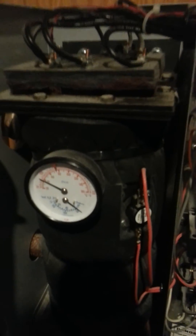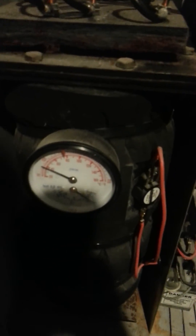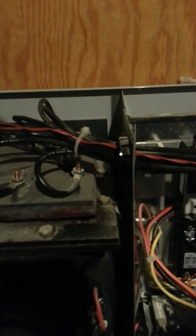Okay, we did it. I checked all these — take my word for it, they're all 240. The new relays are in; they've got a fancy light on the newer ones. You can see my temperature already rising. Before I did this I could only get it to about 90, and it's climbing pretty fast — it should go back to what it was beforehand. The symptoms of this issue you're probably not going to see unless it's very cold outside. Two elements will keep your house relatively nice until it gets cold, but if two are not working you're never going to see it get up to where you want it. If it's sitting around 90 or 80 degrees, you probably have a relay out or possibly a bad element, which you would ohm out.